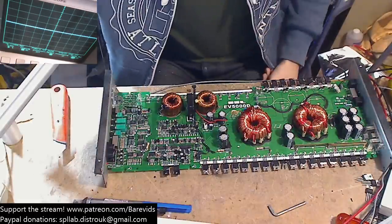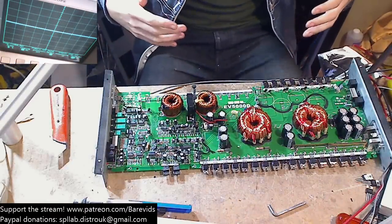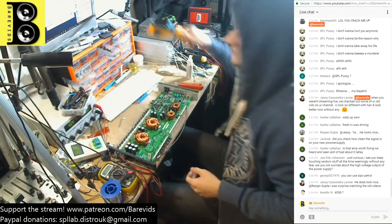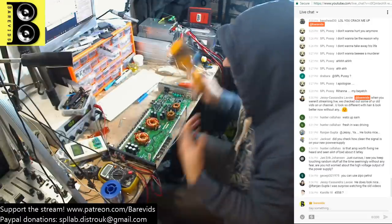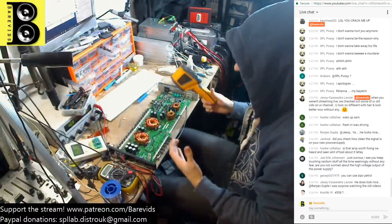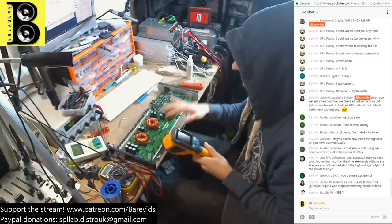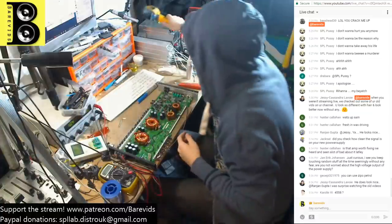But I'm not grounded here. So like in my chair, I'm very, very conscious of the fact that if I need to touch to feel, I mean, this is why I've got the thermal imager now, so I don't have to touch the FETs with the high voltages on them. But if I do need to touch the FETs with the high voltages on them, then I know that I'm not grounded in this position, and I can touch like 60, 80, 100 volts DC and feel absolutely nothing. I'm not grounded at all with the way I'm sitting.